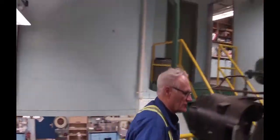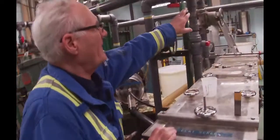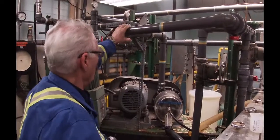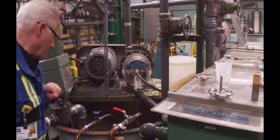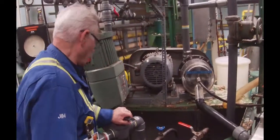So what we've done now is we've got the agitator in stock tank number two agitating the washed stock. And then we're going to pump it from here and bring it to the centrifugal screen. So through a whole rig and roll of piping in here, eventually the stock is coming around to this line — see the arrow on the line? — it goes into the back of the screen. In the back of the screen there's a distributor, so it's going to take the stock and spin it into the center of the screen.